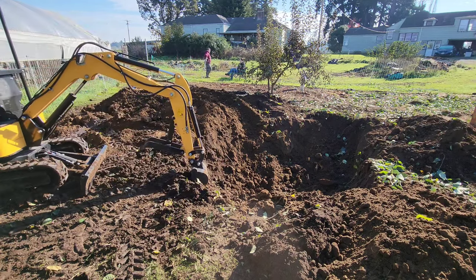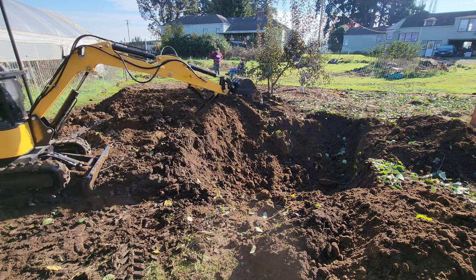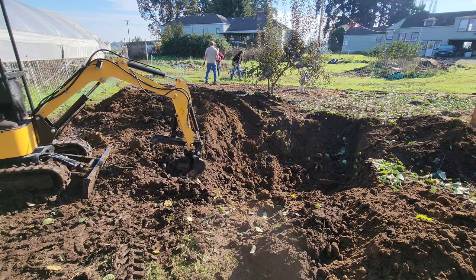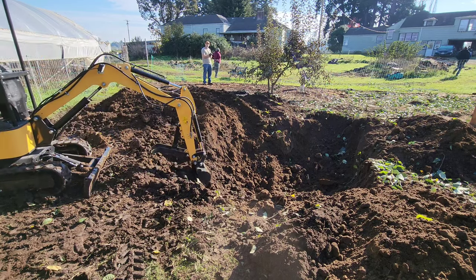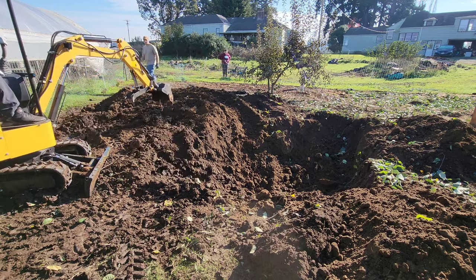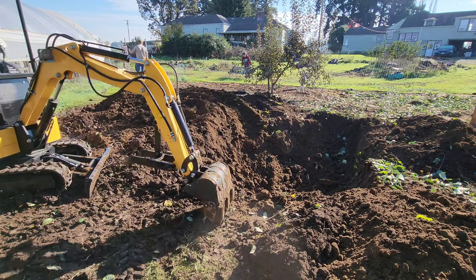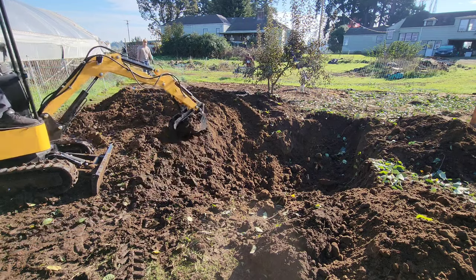In the winter months it's not such a big deal, but if you're running this in the summer, you have that motor with that hot exhaust sitting inside a steel box, and the lid of that steel box happens to be where your seat is mounted. So your backside is going to get very warm very fast. If you don't have any cooling ability, it's just going to bake. That motor's going to get hot. And if you have one of the excavators that has a hydraulic tank next to the motor, which a lot of these do, you're going to heat up that hydraulic oil. Well, that hydraulic oil is being pumped through these cylinders, and those cylinders have rubber O-rings at the glands.